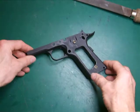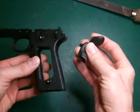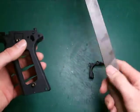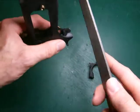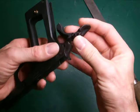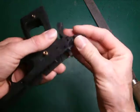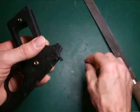In this part I'm going to show how to fit the grip safety to the frame. I know I've gone over this before in other videos, but just to give you an idea that it's not all done behind the scenes by somebody else. All you do is, before you start, offer that up to the back of the frame like so. The tangs on the frame — which are these two bits either side — they'll need to be rounded down in order to get this to fit.